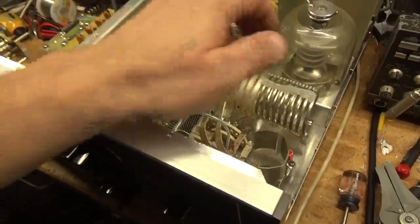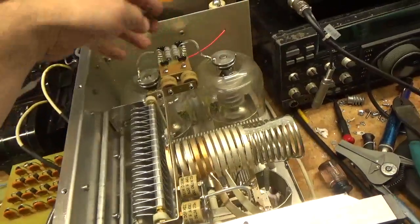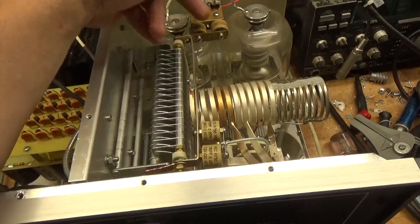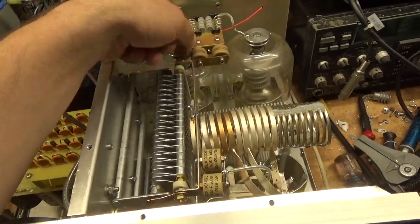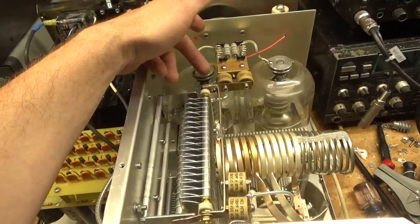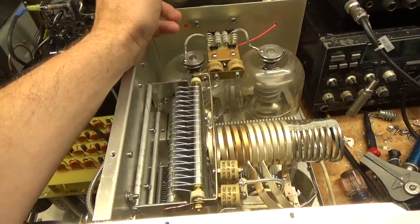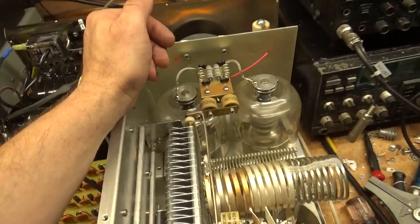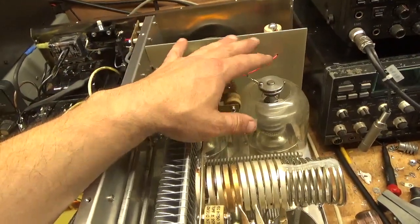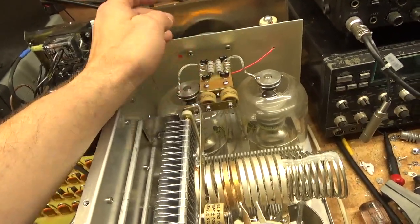So these are also loose. When I ship it back, these caps were still attached. The tubes were out, the caps were still attached and dangling, so all the pressure was on the plate blockers here. These screws were loose. So what I'll do is take these anode caps, dissipating caps, off, pack them together and put them in the outer tube box, because the tubes get double boxed. And I will disconnect this and tape it up to the side so you don't have pressure on the doorknob caps during shipping.